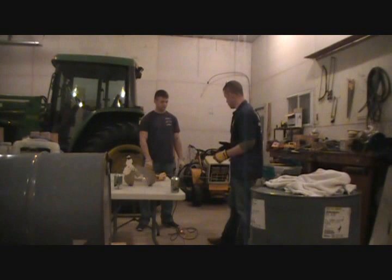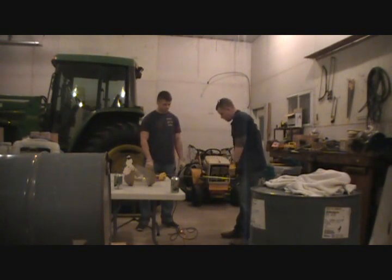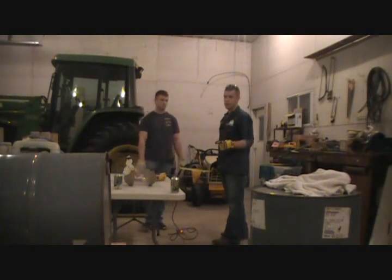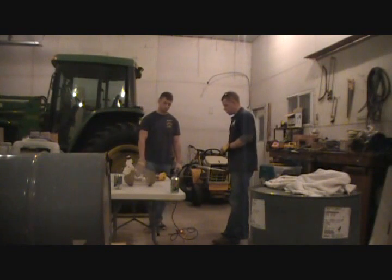The first thing we're going to do is go ahead and cut off 7 inches. All right, so our overall length of the steel band is going to be 73 inches, which is right at about the actual circumference of the outside diameter of the barrel. So it's pretty close. We're cutting them just a little bit short, and we're going to bend a lip on them so that we can run a bolt through them to torque it down like a hose clamp. All right, so that's the reason why we're cutting it off here.